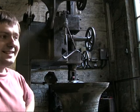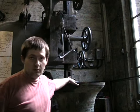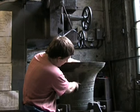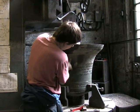So you've taken a slight cut off the top. Do you call it a cut? Yes, that's skirting cuts. And I'll take a cut out of the waist to lower the hum, because that's the area of the hum. Down here is the second partial, which is flat, so I won't be tuning it.